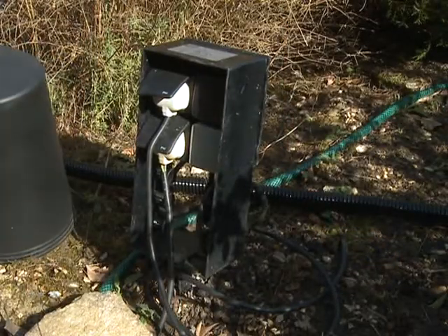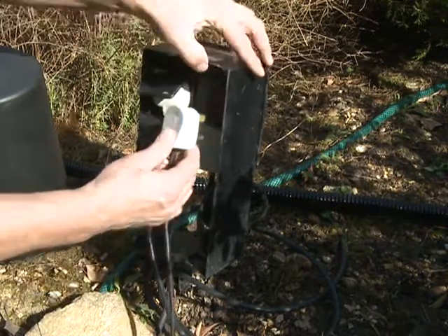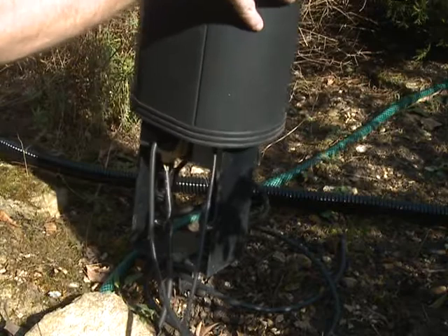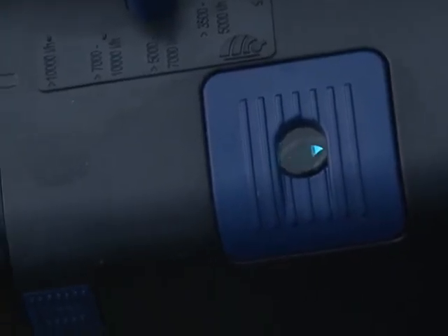This will ensure the correct water flow past the UVC lamp. When all connections are tightened, connect the power supply to the pump and wait for the unit to completely fill with water. Check all connections for leaks, then connect the power supply to the UVC. Check for UVC function through the inspection window — you should see an alternating light to dark blue glow.